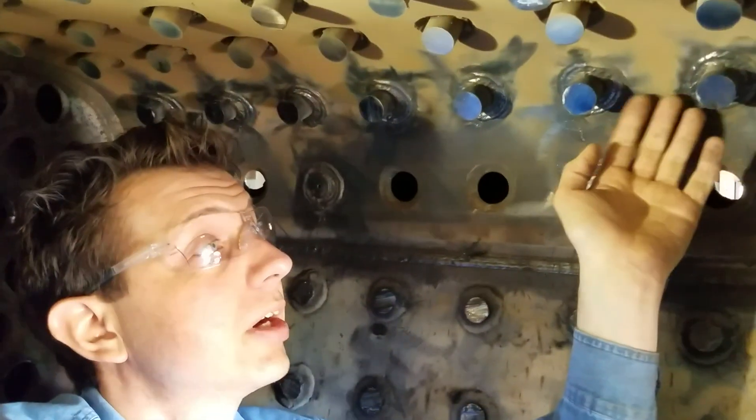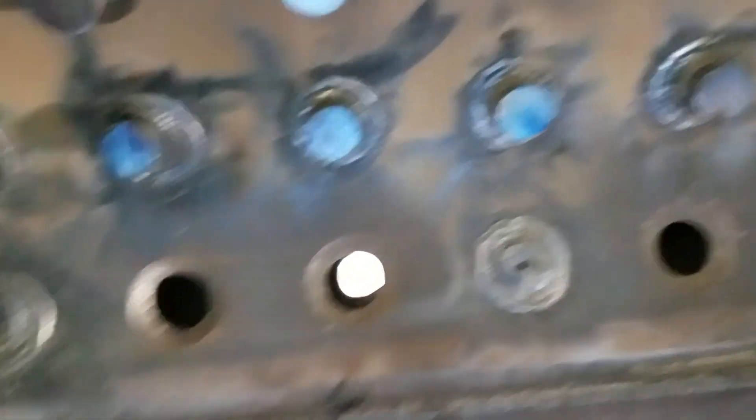You have to visualize what a 45 degree angle that starts an eighth of an inch away from the bolt itself will look like — they get to be about three quarters of the diameter of the rod itself, assuming it's like the outer wrapper. These are a little bit smaller here because this is only 7/16 inch plate, so of course they don't have to be as big. Anyway, I hope you enjoyed this little view of what goes into full penetration welding of bolts. It is not a difficult thing to achieve — it just really isn't. Look at that — beautiful, beautiful bubbles of weld all the way around the bolt. Hope you guys enjoyed!